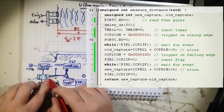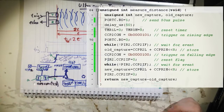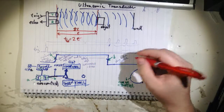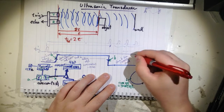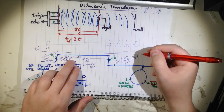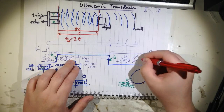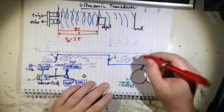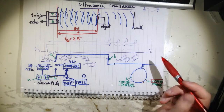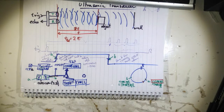And B happens, we get an interrupt, and the value B is then stored until we service it. So then we store B from the same register, CCPR high and low, and then reset the interrupt flag. Then you can return to the subroutine, whatever it was running before. So that's basically it. We will look at the code later in the next video, because this is a bit tricky.